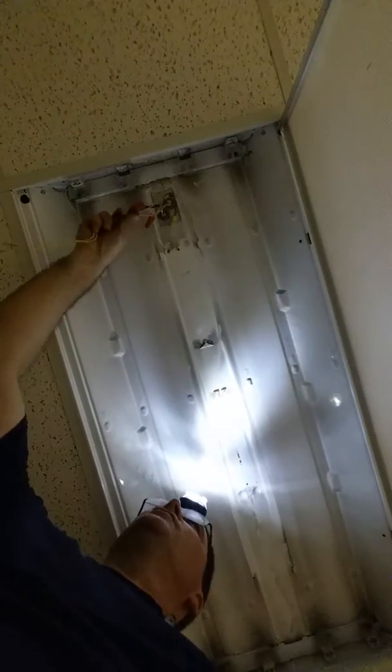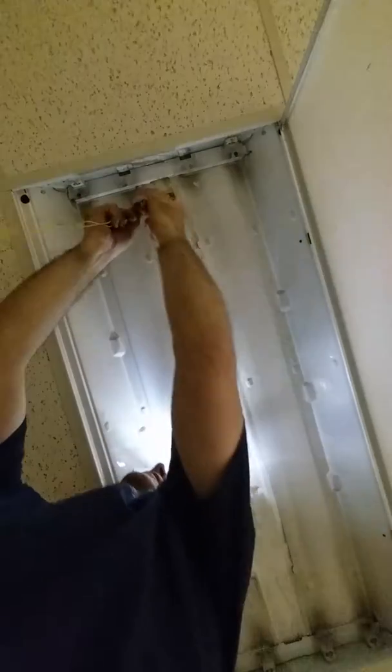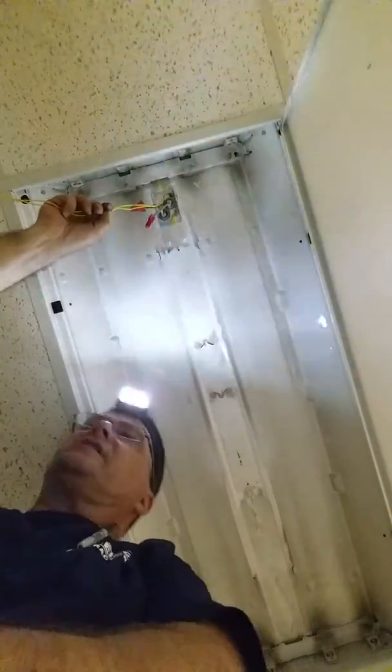So we're going to stick the one side in, and the other side has a little snap that goes right into place. So now, I don't need a lot of excess wire. As you know, as electricians, when you work on these ballasts, there's tons of little wire nuts and excess wire. You don't need a lot of wire in this application.